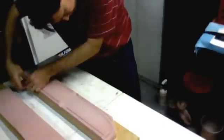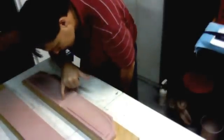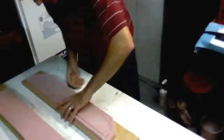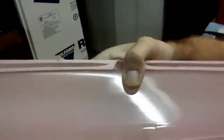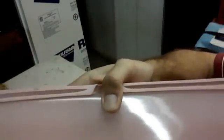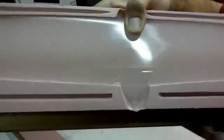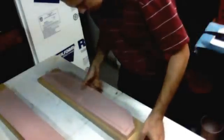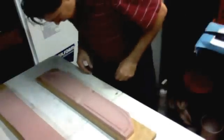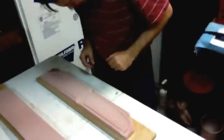My first impressions of the part are actually really good. I've got a bubble here — a decent sized bubble. Let me see if I can lift this up and give you a shot. Basically there's a little bubble right there, and a couple other little minor ones. I can fix that — that's pretty easy. Pot it in with a little bit of extra material. And there are some bubbles along the ridges along the top here, some little pinholes, but overall I'm pretty happy.